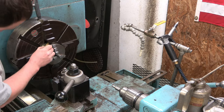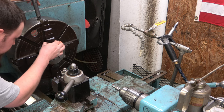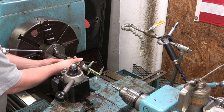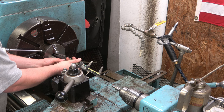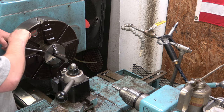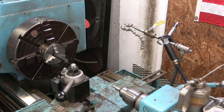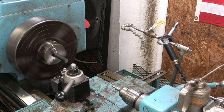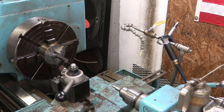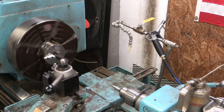Been putting it off. I've got a piece of brass here that's thicker, which might allow us to get this jaw opened up enough. We would probably have to re-indicate that. There we go. Okay. Check the runout. Let's hope that turns out of there. I don't think any of it is from... No, that chuck's still running true. So our runout's in our material here.